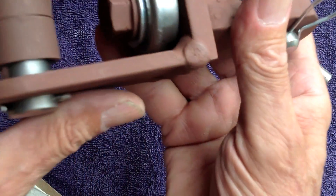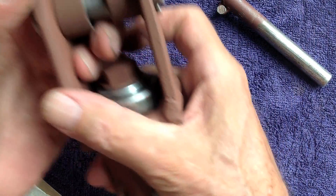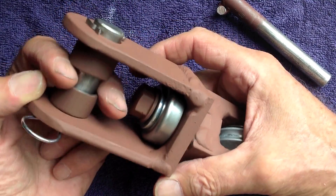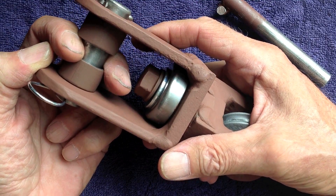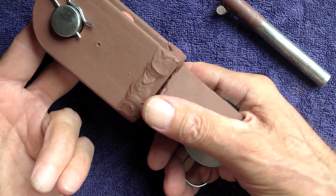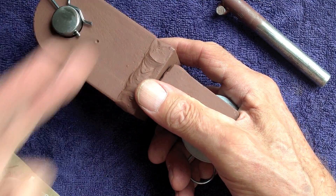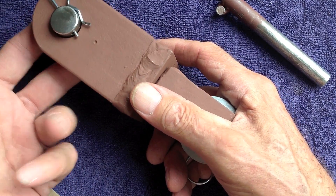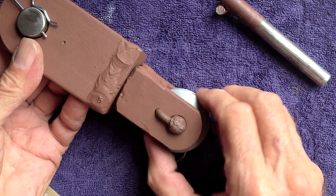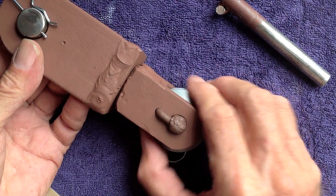This bolt — I put this thing together. The idea is this pin, with my left two fingers wrapped around it — that pin goes through a piece of 3/8ths by 3 flat bar at the top of the staircase. It'll be angled; the staircase is approximately 30 degrees. The thing will be angled 90 degrees with a piece of flat bar — I gotta make another weldment for that. Then the hoist, which is in my elevator, has a wire rope that runs around this and back down to the hoist frame. So it's a 2-to-1.